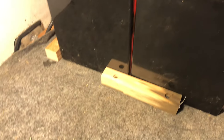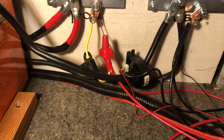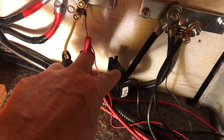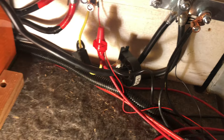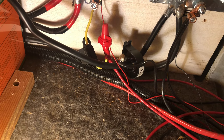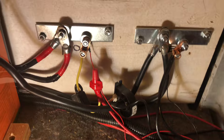I've got them secured down here. I have a plywood floor so I can put these blocks in and these aren't going anywhere. Here I've got the bus bars and the CT meters right here. You only need one CT meter through the negative. On this particular model you can point the little plug towards the battery and it will monitor everything — all the solar going in, the loads going out, and the utility power going in. All you need to do is connect your loads above that point and you're good to go.